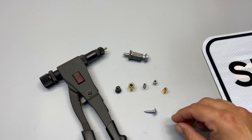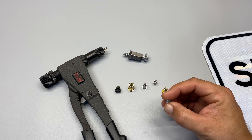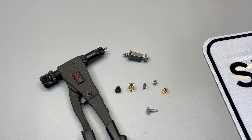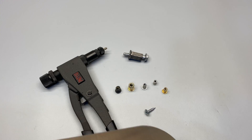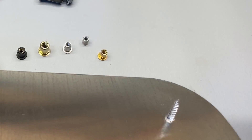The first thing I'm going to demonstrate is just the traditional self-tapping screw. Self-tapping screws are commonly used in the upfit industry and they hold things on, but they don't hold things forever — things are going to vibrate loose down the road. That's almost guaranteed. On top of that, something like this on the inside of a panel is a good way to cut yourself, and that hurts.